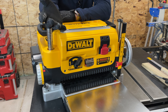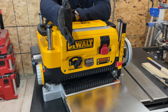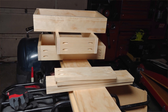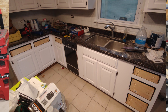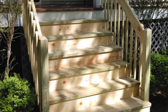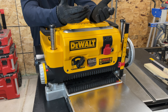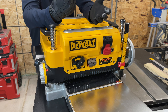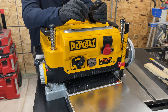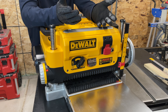Post in the comments what brand do you have and how much do you like it, because this is the only benchtop planer I've ever owned. As a do-it-yourselfer, having a wood planer will elevate every project you do. Before this, drawer boxes would be three-quarter inch stock — they should be half inch. When I built the staircase on the front of my house, a month after I built it they had a bad cup to them. Taking them off and running them through this planer — if you go little by little, you can work the cup out of a big heavy board. And now they're flat, they look great, and you don't feel a weird cup when you walk up the stairs.